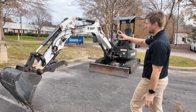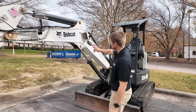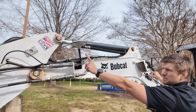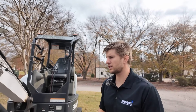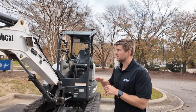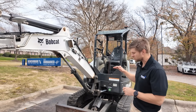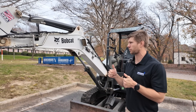Where the system starts to differ is right up here at the boom. You will not have a boom sensor on the EZNAV system because your position is tracked from two antennas — the main antenna and the aux antenna. That's very user-friendly and helpful because those antennas will actually pick up the position forward of the machine, so if you have a swing boom there are no issues — it picks up swing boom and works appropriately with that.